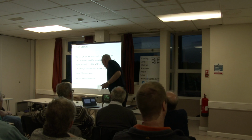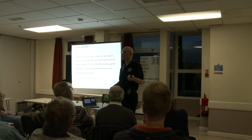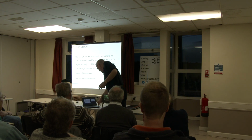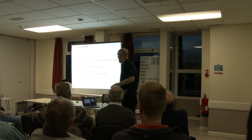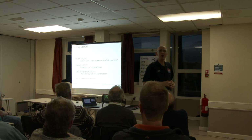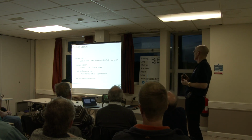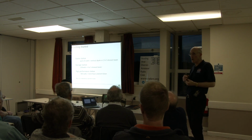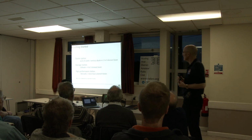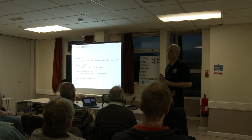So if you want to work, and DX is a relative term, if you want to work outside this country, then you're well off either going digital or SSB, CW. You can work things on intermediate powers. You can work it on foundation power, on whatever you can get, and you'll work something. As a starter, the weakness of the vertical, particularly, but also dipole, is really going to be noise pickup rather than anything else.